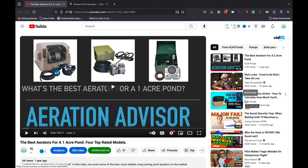When we look at the aerators in that previous video — I'll link to it below so you can check it out if you're still in the search stage — these are all quarter horsepower systems with a single diffuser. As I've said in many previous videos, if we can get a diffuser down to 12 feet or deeper, by manufacturer specifications, we can cover up to about an acre of pond area with that single diffuser.